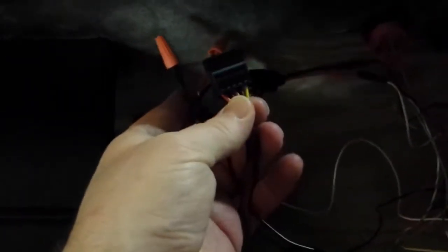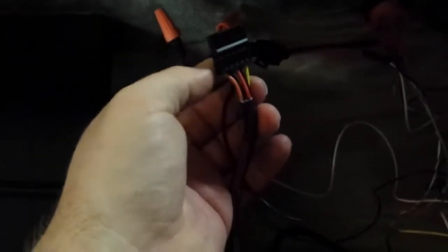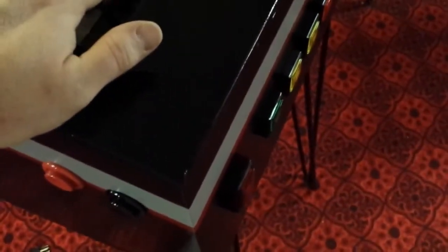The yellow is 12 volts, and like I said, that would probably power them all, give them a little more juice, maybe make them a little bit brighter. But because the Nova Gem is on a 5 volt setup, what happens is, if I can find it, there's a resistor in the line for the Nova Gem, and it backs it down to 5 volts.